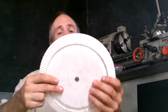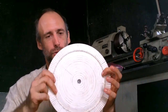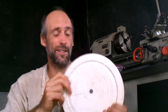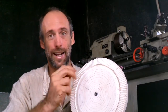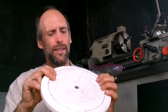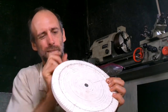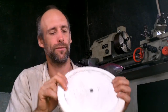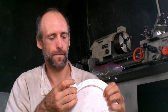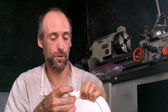If I do that though, I'm going to build some mechanical thing where I can control the rotation when it's on the milling machine really precisely, so I can get these teeth lined up as exact as possible. They're pretty good right now, but I can see every once in a while there's a tooth that's a little bit fatter, or a slot that's just a little bit off. Still definitely usable. Maybe I'll get lucky and this will totally pass the test.